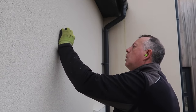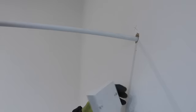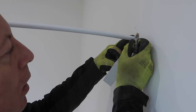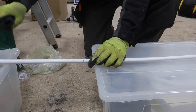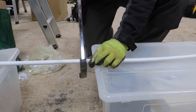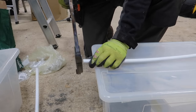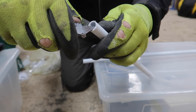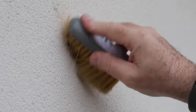I ended up around an inch away from where I predicted, which wasn't too far out. To bridge the cavity I use a length of 15 millimetre PEX pipe, which I insert flush with the outside wall so I can go around to the other side and mark how long I need to cut it — I want it just protruding into the back box. This PEX pipe is actually for water, but the 15mm pipe in a 22mm hole gives plenty of room to get silicone all the way around and achieve a good seal.